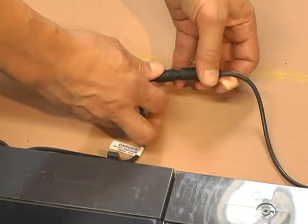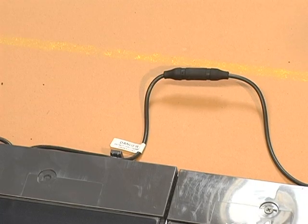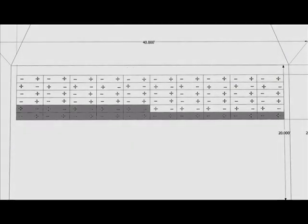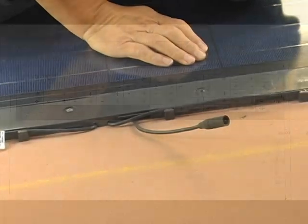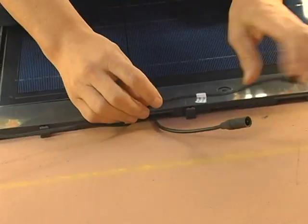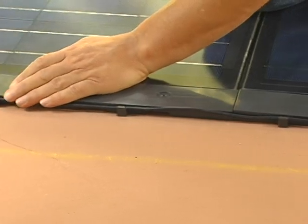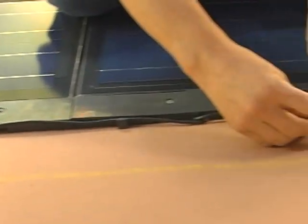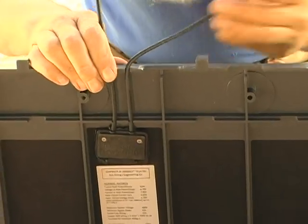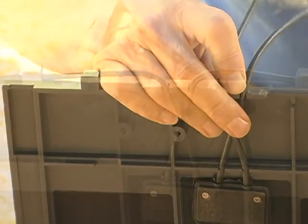It's extremely important that the connectors are completely engaged, tight and secure. If not, the system will not function properly. Typically, a string of shingles will be divided between two or three courses. When this happens, it is necessary to reverse the orientation of the output cables on the next course to complete the connections. Just remove the cables from the cable tracks on the shingle and switch them. If the shingle is already installed, you can cross the cables at the point where they emerge from the frame, but it is best to switch the cables before installation, removing them from the slots on the frame and making the crossover at the back of the shingle, then putting the cables back into the slots.